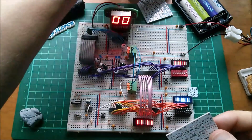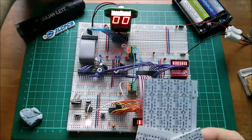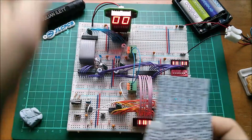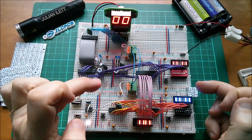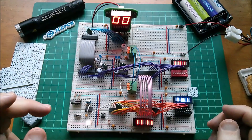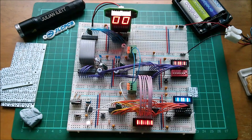So if you stop the clock with that, it links through here and you can single step it using that micro switch. If you go to CMOS, these resistors need to be reduced from 1k to 100 ohms. I'm very pleased with my little breadboard linking PCB — I'm quite glad I made a lot of these. It didn't look at first like it was going to make a huge amount of difference, but the more of these things you put in and link together, you just get better and better power distribution. It's been a result — excellent, cheerio!